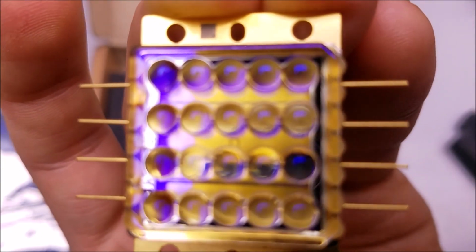But what I wanted to point out real quick, when I change the focus again, is what's inside. So, set it like that. And now we can see the laser diodes. If you take a look at the bottom row, there's a laser diode behind each lens. These laser diodes on the bottom sit on that side of the wall, and there's another little shelf, so scoot up like that. Now we're taking a look at the third row, and these are in the same orientation. If we go up to the second one from the top, you'll notice that the position flips 180 degrees, and now they're on the bottom of a shelf. Go up to the last one so you can see it a little bit better. Yeah, they're 180 degrees opposed, which is interesting. So against that wall, and then over here against that wall.